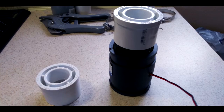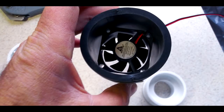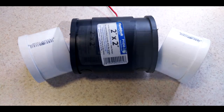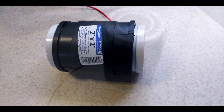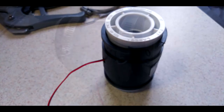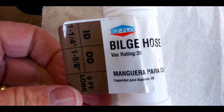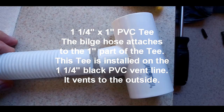Once I got the part made for the toilet itself, I took a 2-inch 12-volt fan, rounded off the corners so that it would fit inside of this 2-inch black PVC rubber coupling. It's got a 2-inch by 1-inch PVC adapter pushed in at each end, which basically pushes up against the little fan. Once all that's in place, the clamps hold it into place. The next step is using a bilge hose.